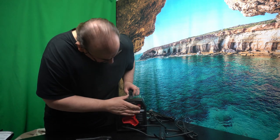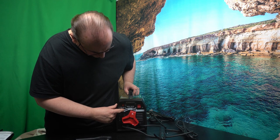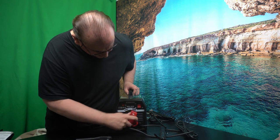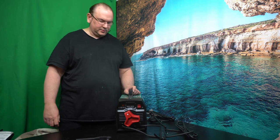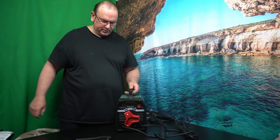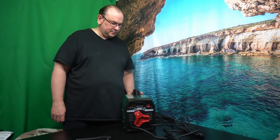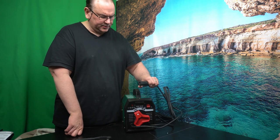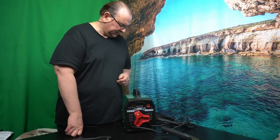This is the front side. It has on and off, and then it basically only has two modes: that's for the 1.6mm or 2.2mm sticks, and then that's for the 2.5s. Basically, that's the benefit of really simple, cheap stick welders — they actually don't have that many settings. They'll either work or they won't. The durability of the holder and stuff will be seen in usage.